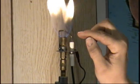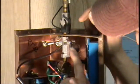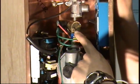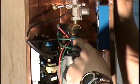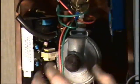It comes out of this prong into that prong, back through the burner, back through the valve, through the regulator, into the solenoid, and then the signal is picked back up with this screw right here and sent back to the solenoid. Then it's sent through the wiring harness back to the black box. That's what keeps the light going.